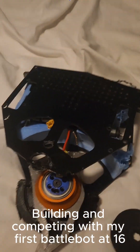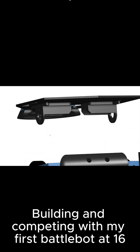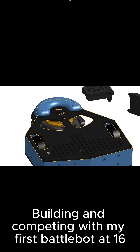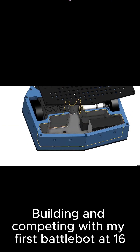I have this sandwich of polycarbonate plates on top. Here's the CAD model — you can see it's all destroyed and exploded. This is what it looks like when it's not damaged. When I put it back together, it's going to have these hubs that the motors screw into — right there — and then I screw them through the top, through the bottom, where I've got some heat set inserts. I also have this interior liner made of TPU, which actually helped a lot because the internals would otherwise spill out.